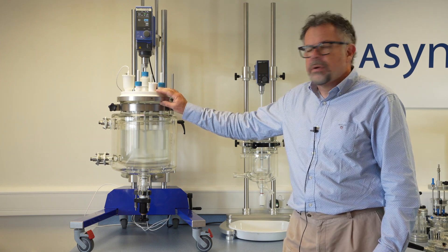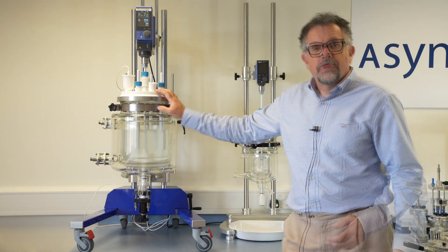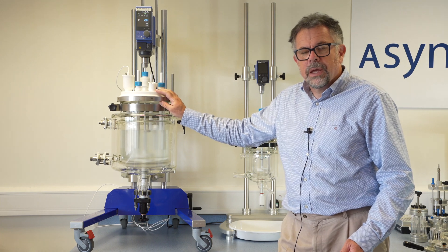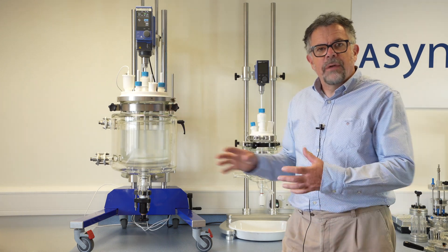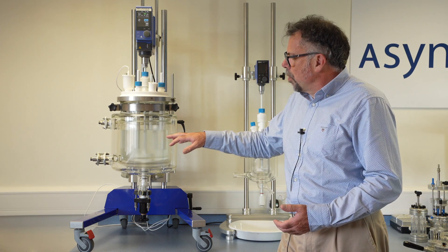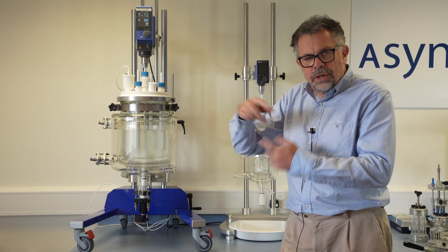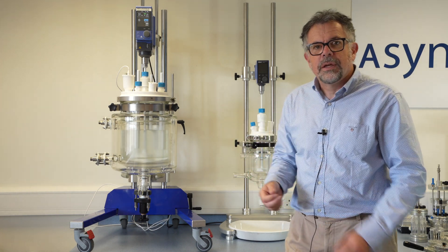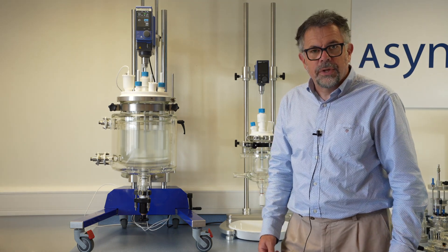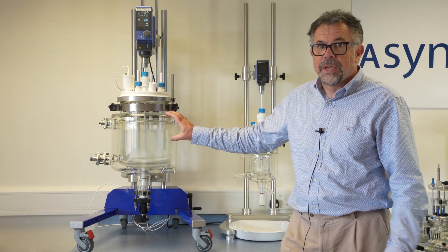With this vessel we have a 200 millimeter flange which allows us to fit these baffles. The baffles have been designed with the input of a company called Analytical Innovations — I'll put a link below and there are videos showing how these baffles affect mixing. With the stirrer motor running quite quickly, there is no vortex in the middle; the contents aren't just spinning around — they are properly flowing and mixing together. This is a very important consideration, especially if you've got exothermic chemistry. Baffles are probably more important than you may realize, especially on scale up.